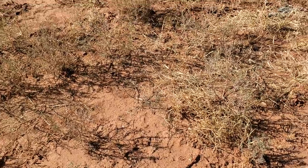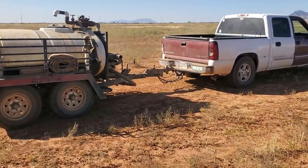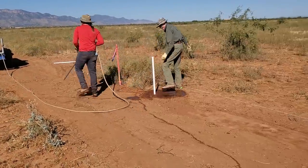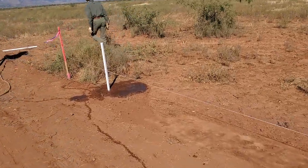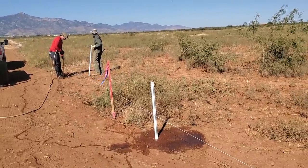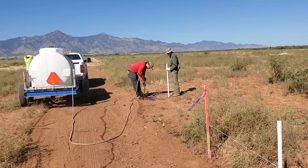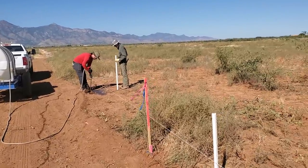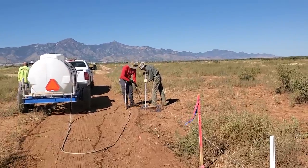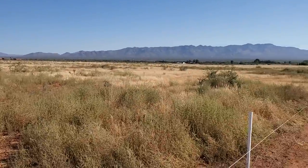Here we've got another water truck coming in. We've only got about 300 gallons left in our other one, so that ought to finish it right there. We're going to pump that water into our big tank, so we're going to have plenty of water. This is actually going really quick. The other day we drilled some of those holes and hit a rock — our record was eight tries, having to move that pipe around eight times to get one post in the ground. But once we got past that area, it picked up pretty quick. When you hit rock you're not going to shoot a water jet through it — you've got to pick it up and move.